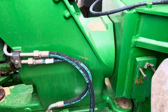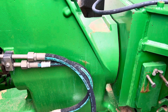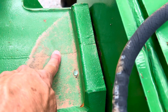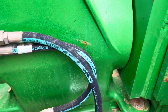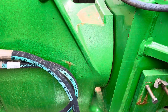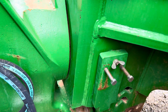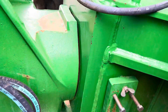So we're going to start — this is a bushing style because it does not have a grease fitting. You can't grease the bearing. I'll show you the next one — you can see the grease elements on it. Also, when the gudgeon goes bad, it typically gets into your spindle, but unless it gets into your rear frame, you don't even have to replace your spindle. Upgrading to the bearing style solves that.